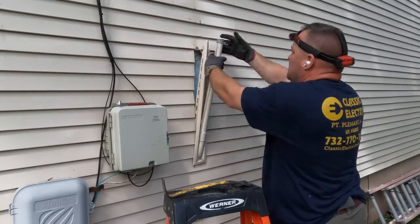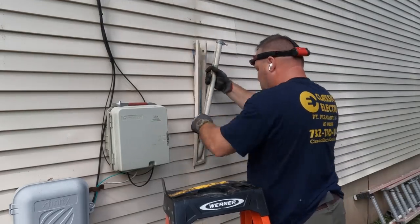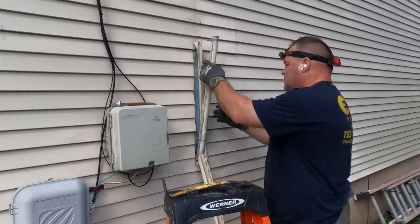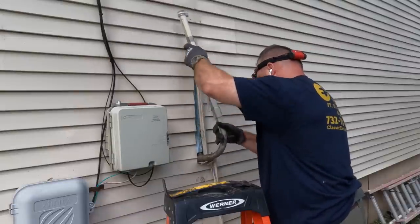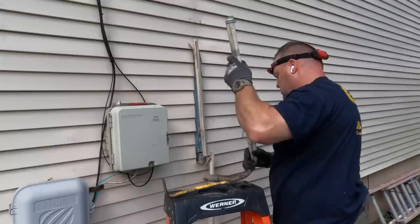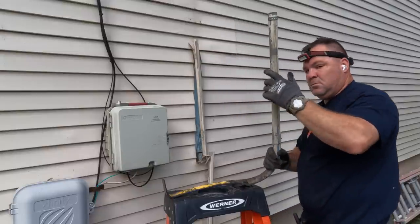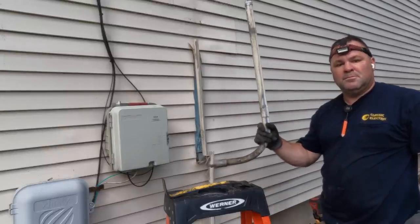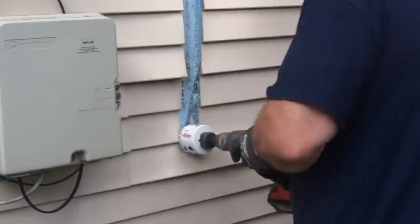I really got lucky pulling this old conduit — looks like one-inch conduit with three number-four coppers going up there for the 100-amp service. I got really lucky getting the whole 90-degree bend out in one piece. Very lucky. I originally didn't know what I was going to do about covering up that old J-channel, but you'll see in a minute what I do.